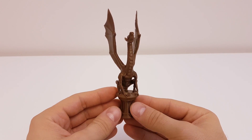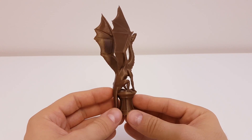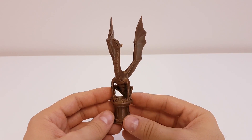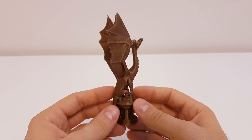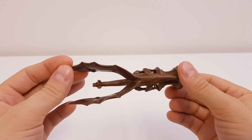This dragon from Luby3D, printed at 40mm/s on 0.1mm layer height, shows fantastic results and details. Here the salmon skin artifact actually adds a nice texture to the dragon, especially on the wings, which now look more realistic like actual skin. I think this artifact actually looks very nice on this dragon.